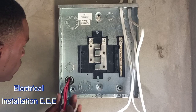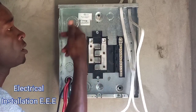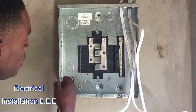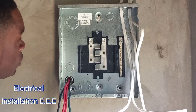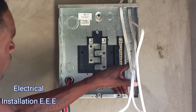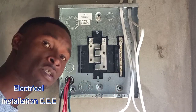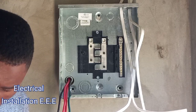First thing first, what I notice is that this panel doesn't come with an earth lug attached onto the body of the panel. It only has the neutral bar right here. So what I'm gonna do, I'm gonna get one to put in and mount on the body to actually get a link to the neutral bar, because the neutral and the earth are related so they have to be linked — so we're gonna get one.